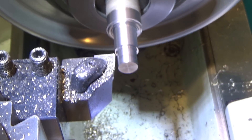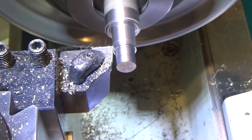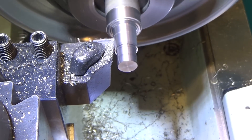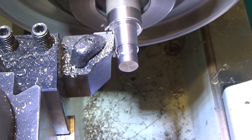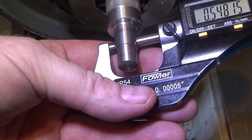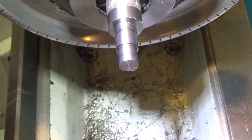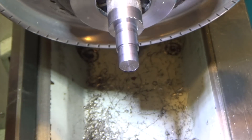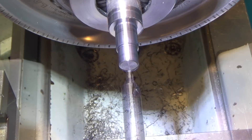Last 25-thousandths. The problem is the part's hot enough that I really can't count on my measurements — it'll be off by a few thousandths — and since I am shooting for accuracy, we're going to need to fix that. We're shooting for .548, and here we are. Now I just need to chamfer some edges here, here, and here. Then we will come back, center drill to depth, and then take it over the mill and cross drill and mill the flats for the bolt head. We'll start with the center drill.